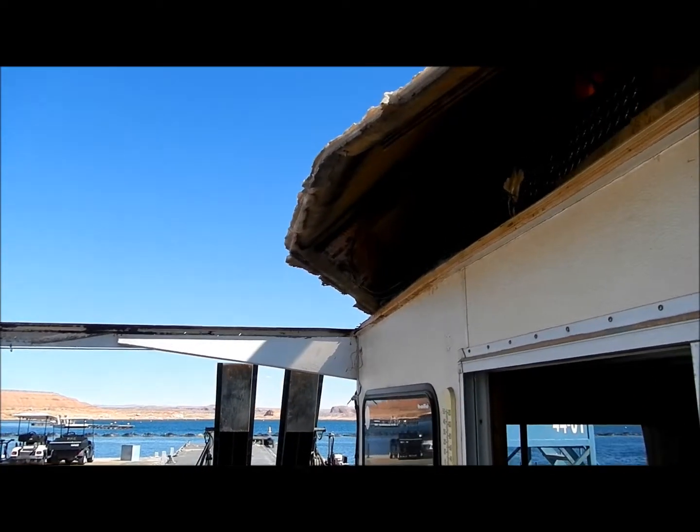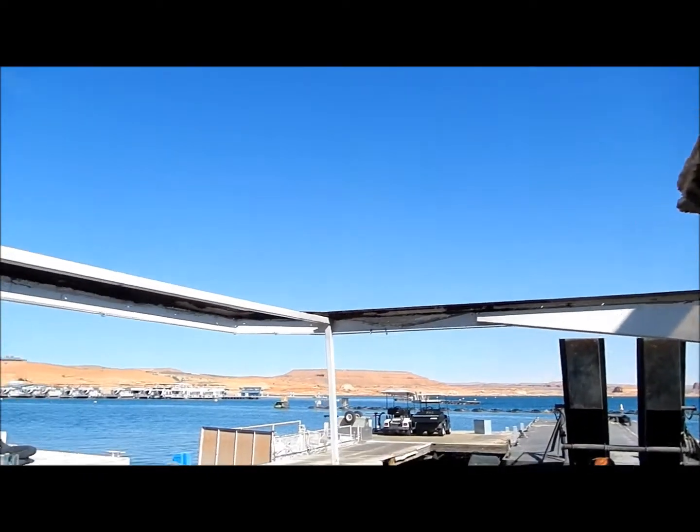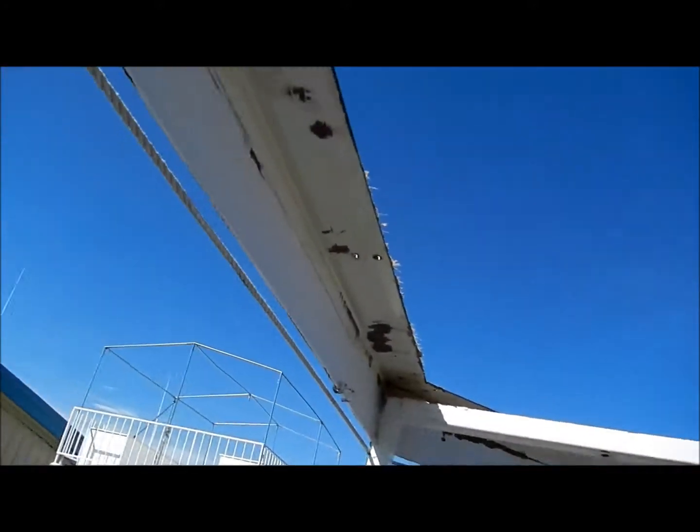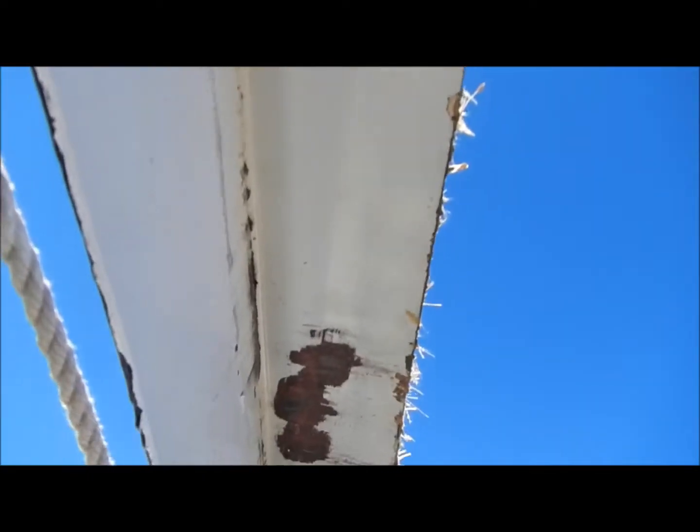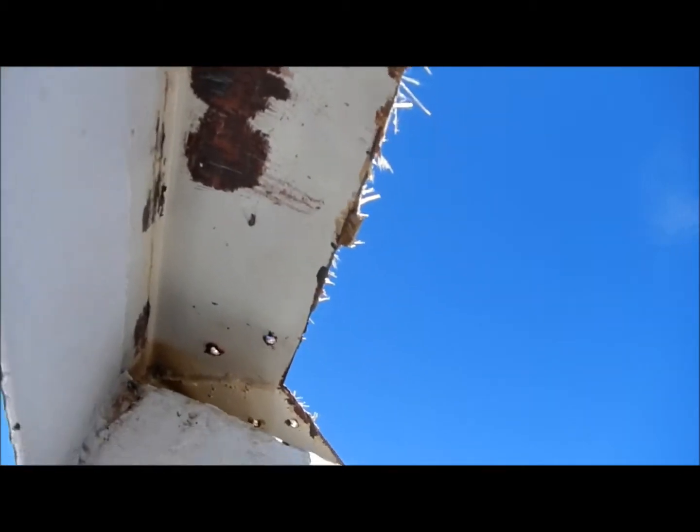Now, what's happening with the fastening of these things is, as you can see right here, there's exactly a 3-inch lip all the way around with holes in it. All of the material we put down is going to be screwed from the top, holding it up. That's how it's supported. Of course, this is the crossbar.